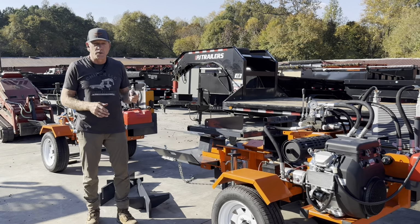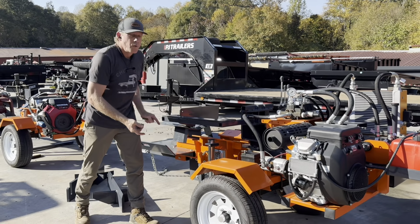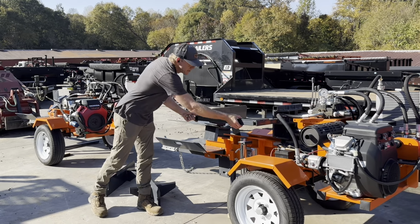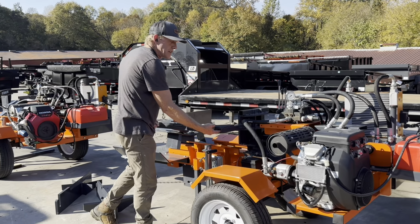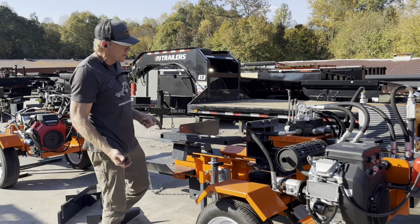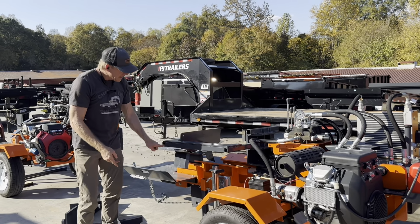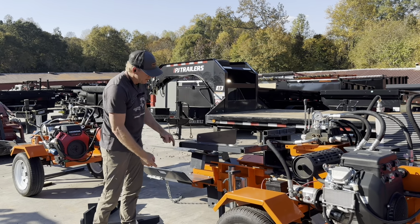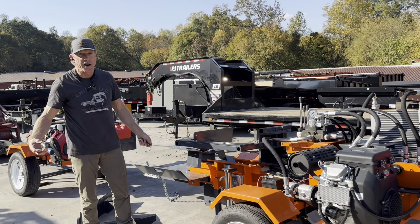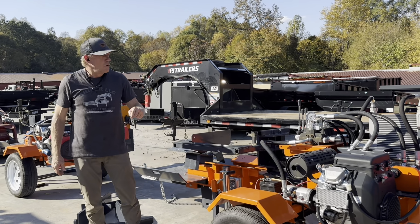As I sit here and talk about all the things that we want to do for you, I'm like, we're going to do it all. Even this retract arm was a really quick and easy fix. All we have to do to give you a heavy duty retract arm, as you see, this is already heavy. It's just, for whatever reason, and it does make it lighter, they just use tube here. So when you pick it up, it's not so heavy. But what we're going to do for you is anyone you get from us is going to have a 1-inch solid steel rod inside of this, welded capped on the end, and 1.25-inch square solid rod in here. So when you get it, if you want it to be light, you take an angle grinder, you grind your welds off, you can slide your piece of solid rod out, and you can have a light duty. You want heavy duty? Leave it as we do it. We're going to send it to you heavy duty. So these are the kind of things that we'll do.